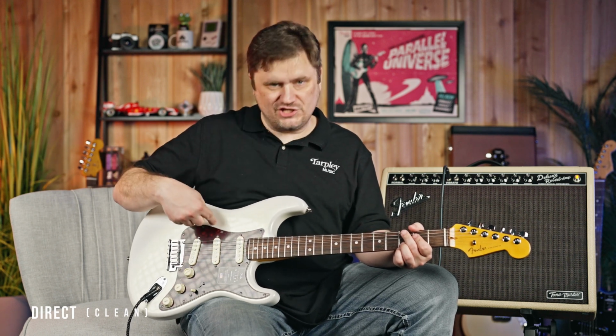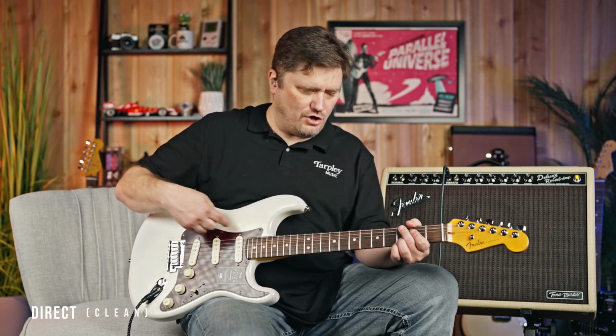All right, we'll do one more. So we're going to position 2. We still have the S1 switch on. So position 2 gives us the bridge and the middle. S1 adds the neck. So now we've got all 3 going.